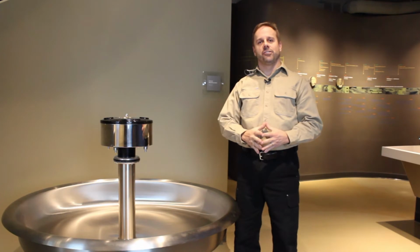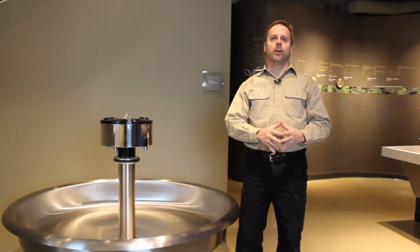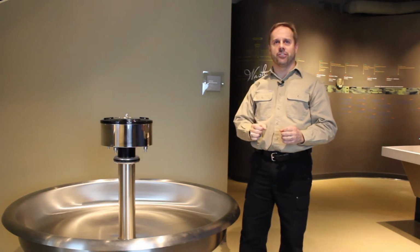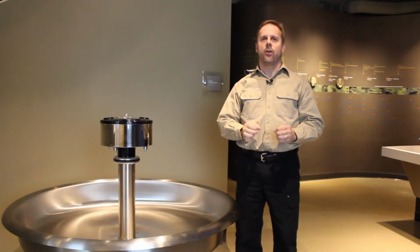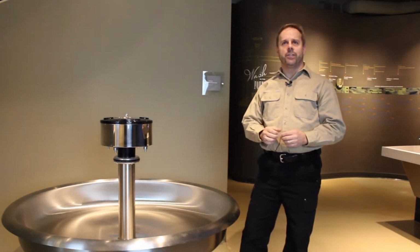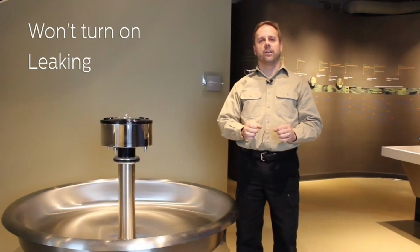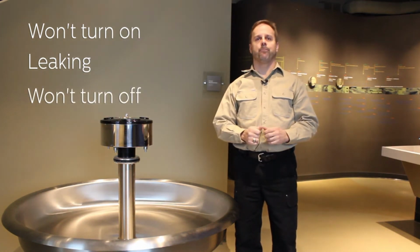Foot pedal activation is the most widely used activation style for Bradley wash fountains. To troubleshoot a wash fountain, it's best to use a process of elimination. If you can eliminate a few issues, what you're usually left with is the problem. This video will cover the issues when the unit won't turn on, when the unit leaks, and when the unit won't turn off.